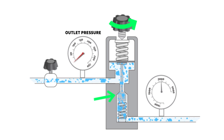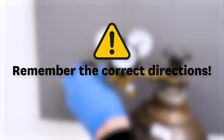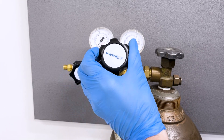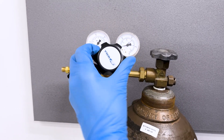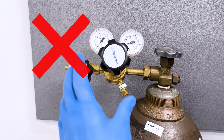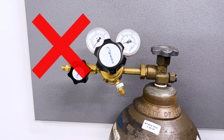This is the safest position to start with, before pressurizing a regulator. Remember the correct directions. It is not uncommon for people to mistakenly turn the pressure control knob in the same way as a regular valve and tighten it up all the way clockwise, thinking that will shut off the flow. As we have seen, that is completely wrong. In fact, it might even damage the regulator.